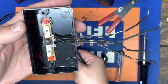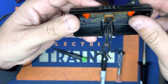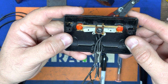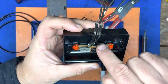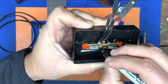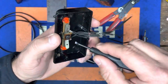This plate — as you can see — is pretty simple. We're going to remove this screw. As I stated, it's stacked on the inside. Each wire is actually hooked up to one of these sections, and that's where we're going to mark them. We started out with number one on the end here, and that's going to the very top one, so I'm going to put a single dot on that one. Then we'll keep track as we go along and go ahead and remove this screw.